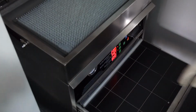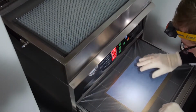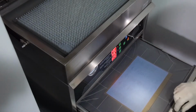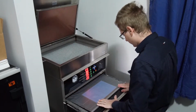We have a special machine that allows us to process our photopolymer plates. First we harden the areas left exposed by our negative with a UV light. You really should do photopolymer work in a dark room, but I have found the fluorescent light globes we have don't emit enough UV to cause any discernible difference in the outcome.